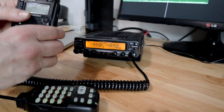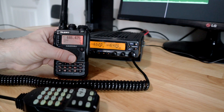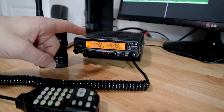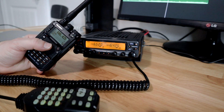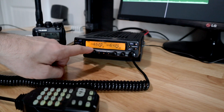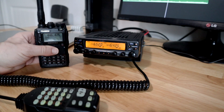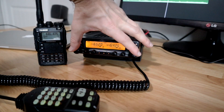So I've got 446.425 set up on low power with a stubby antenna. The way this works is if you have this radio in your car — or set up as a base unit — you can walk away maybe half a mile to a mile and use it as an amplifier on that frequency. If you're in a hole at a trailhead and want to extend the range of your HT, you can use cross-band repeat to do that, up to 50 watts out with this radio.